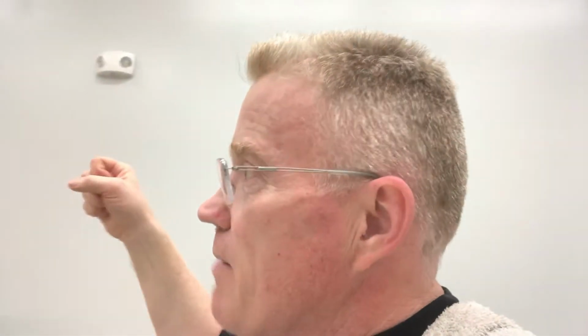So I just wanted to show you now, the way you hold the wallpaper when you're going up your ladder is crucial because it can tear. So you want to make sure that you have the top sheet against your body, because that is the sheet that you're going to hold, and you're going to drop the rest of it so that you're left standing with the top of the first sheet in your hands when the bottom will fall down.